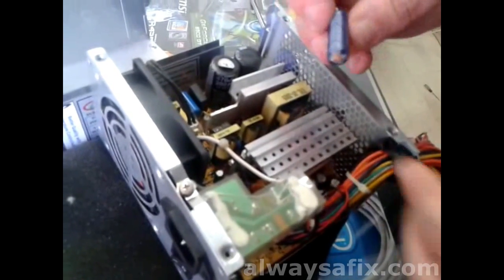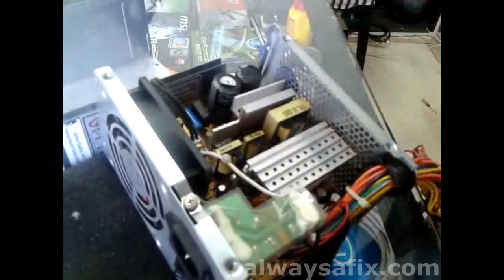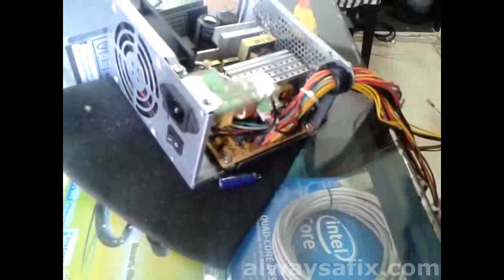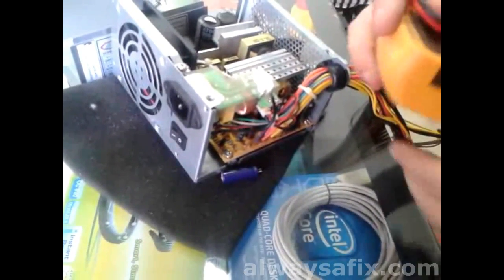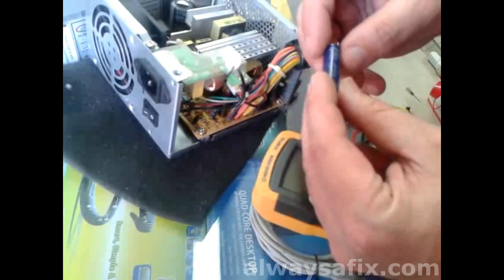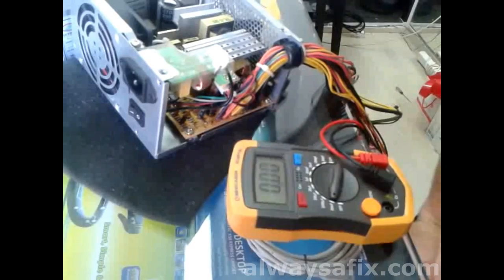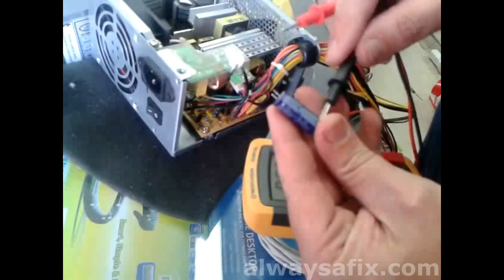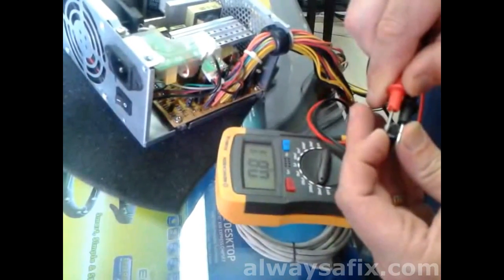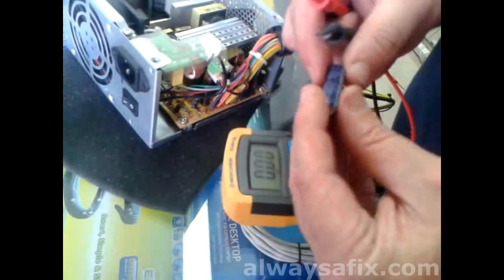Here's an example of a bad capacitor — it's swollen at the top and it's leaking. If you put it down on a flat surface, you see it won't even stand up. I have a capacitance meter here which I use to test the capacitors. This one says it should be 2200 microfarads. The negative is always the side that has the stripe, the band. And you can test it — this one is about 800. So that's an example of a bad cap.